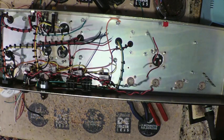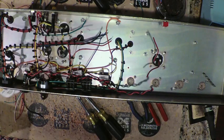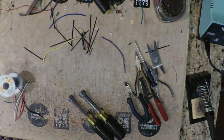So at this point, I'm probably going to want to put in the potentiometers. Right now is a good time to do that. So I'm going to grab some potentiometers and some of my nut drivers. So let's start doing that. All right, so we also have to build the Jose master before we can put all the pots in, because we're going to want to put the ground bus on that as well. So you know what? Let's build the master volume unit for the Jose. Let me move this whole assembly out of the way here, and we'll put it over on the floor.